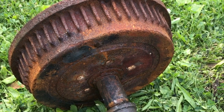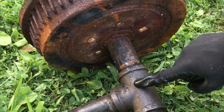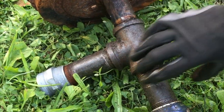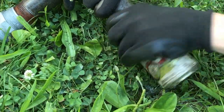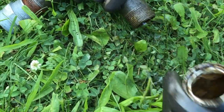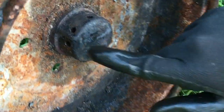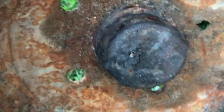Here's the main body of the forge. It has a brake drum on top connected with pipe to a T that leads to the air intake and to this aluminum can on the bottom that catches any water or ashes that fall down into the pipes. Inside the drum there's a pipe cap with eight holes drilled in it which allows the air to flow into the drum.